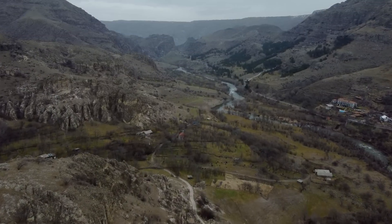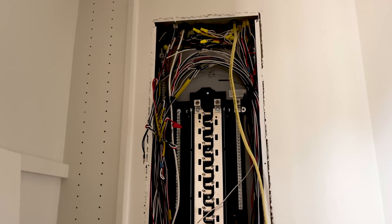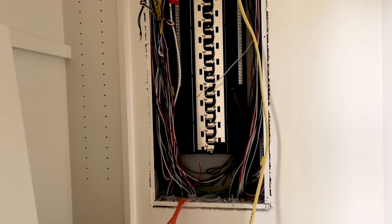One crappy thing about this job is that we took it over from a different electrician. It's about an hour and a half out in the hill country, and the previous electrician did a terrible job. They ran California three-ways but didn't wire them together correctly, and used panels as junction boxes. There's weird PVC conduits coming in the bottom of the panel with strange wire colors — blue conductors and stuff — so we had to spend tons of time toning out where all of these wires went.